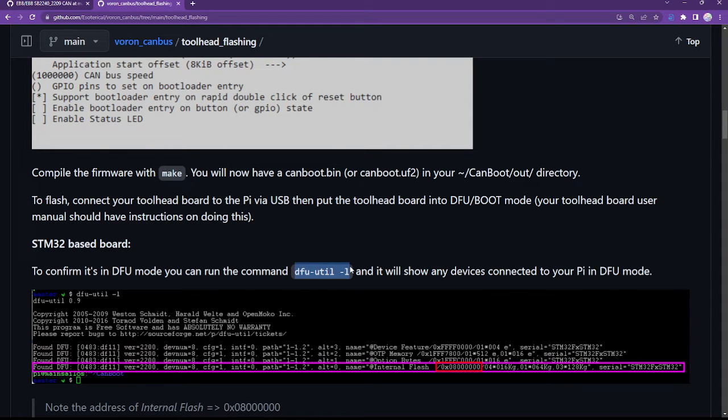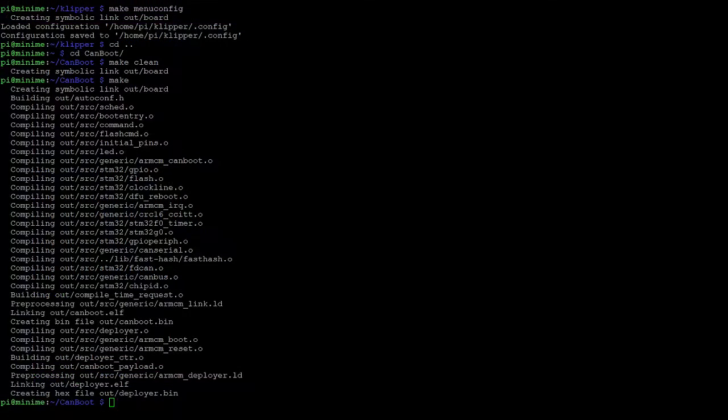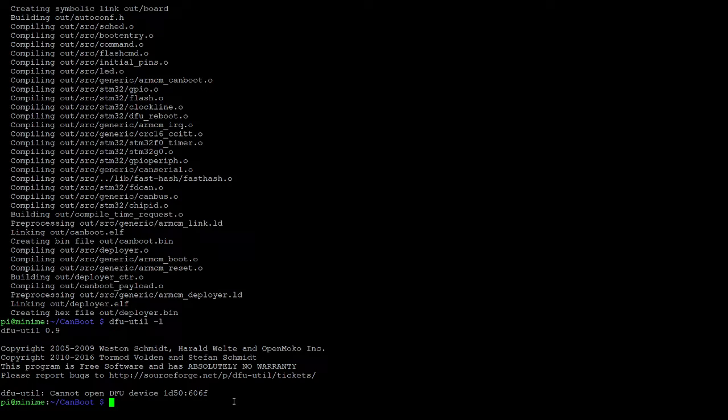I might need to press the button and do that again because I don't think I put it in DFU mode. So let's copy that command. And if it doesn't show up here, then I've got to do it again. Yeah, cannot open DFU device. So before plugging in the cable to the Pi,